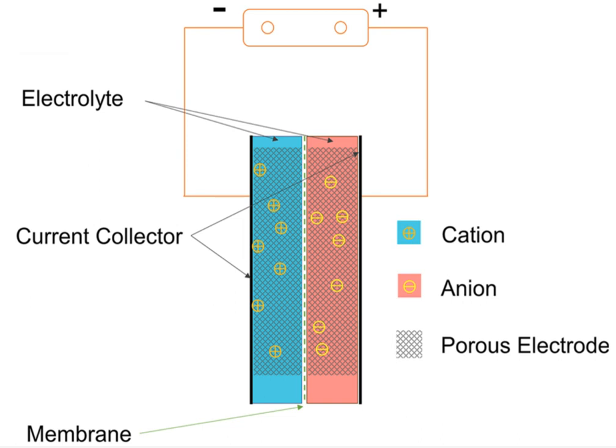For asymmetrical supercapacitors like hybrid capacitors, the voltage drop between the electrodes could be asymmetrical. The maximum potential across the capacitor, the maximal voltage, is limited by the electrolyte decomposition voltage. Both electrostatic and electrochemical energy storage in supercapacitors are linear with respect to the stored charge, just as in conventional capacitors. The voltage between the capacitor terminals is linear with respect to the amount of stored energy. Such linear voltage gradient differs from rechargeable electrochemical batteries, in which the voltage between the terminals remains independent of the amount of stored energy, providing a relatively constant voltage.